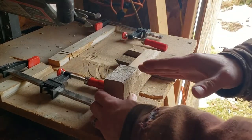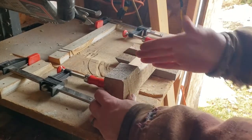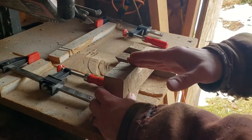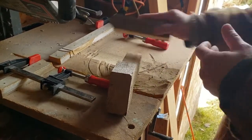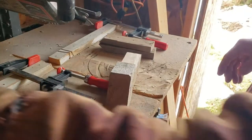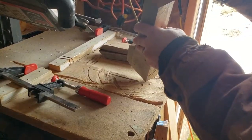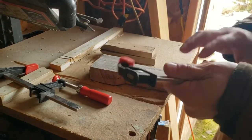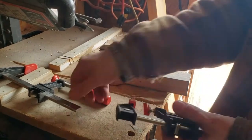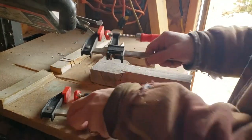It'd be trickier, but taking just a skill saw, putting it on a 45, making sure everything's adjusted up there, putting your line on there. And you could probably do this with a skill saw. Might not need to have a radial arm saw to do this, but that's the basics of it. If I 45 these angles here and make it kind of the octagon, like a stop sign, that'll just make it that much easier when it comes down to wood turning it.